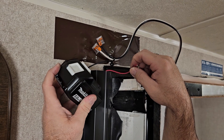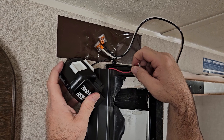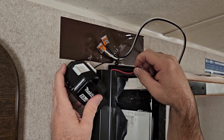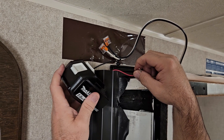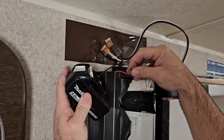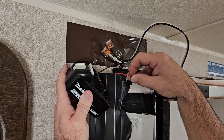You're going to have to alternate corners of the slide out box — go to the right side, do the same thing, come back to the left — alternating back and forth until you've walked this room into the end, fully retracted sealed position. Then you can go ahead and get it to the dealer and find out what's going on. This is another option over the override or the bypass at the motor controller.